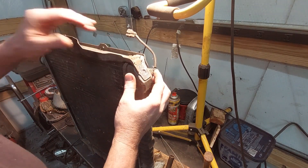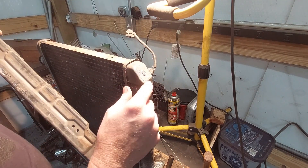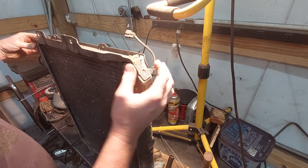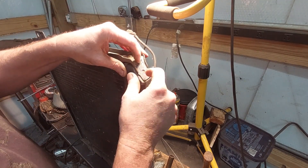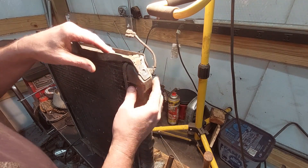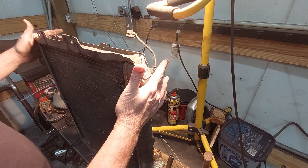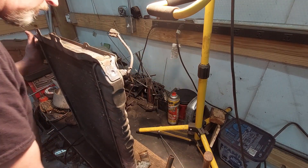The first thing I did was take this piece off and clean the underlying metal with a wire brush. I cleaned the backside of the metal with a wire brush too. I'm going to try to concentrate my heat on this piece here and on that little stub there, and get the metal to flow inside of here. I really don't want to heat the end tank too much — I just want to make this bracket strong enough to hold the radiator. This is going to be on my stationary engine stand, so I'm not terribly concerned so long as it holds.